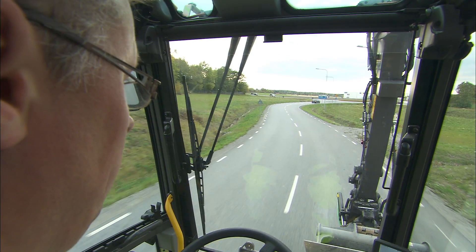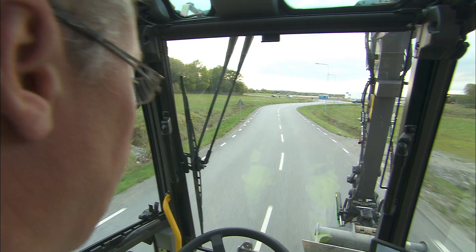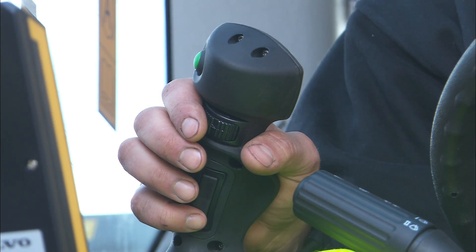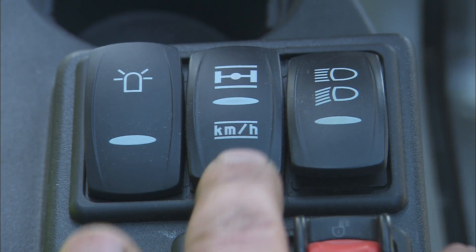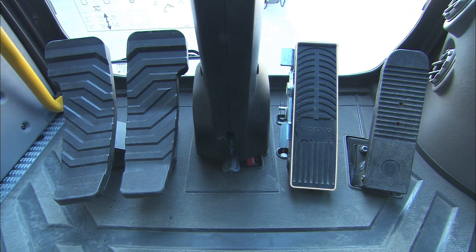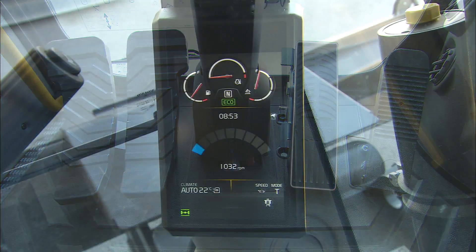If the symbol is yellow, it will be deactivated automatically when you raise the control lockout lever. Be familiar and confident with all travel controls, like the direction switch on the right joystick, the travel speed switch, cruise control, as well as the travel pedal, and the service brake. To achieve fuel-efficient traveling, it's highly recommended to enable eco mode before starting to drive.